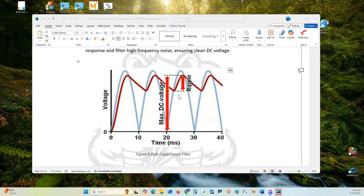As we noted in the electrical characteristics, there is a 120 hertz ripple rejection. This feeds into an electrolytic capacitor of 470 microfarads, and then into a 0.1 microfarad ceramic capacitor. The ceramic cap is for spurious spikes coming down the line, shorting them all to ground. This then feeds right into the LM7800 family voltage regulator, which regulates it and outputs a smooth 12V DC regulated output.